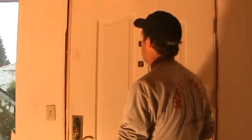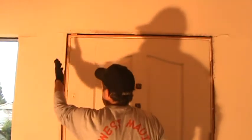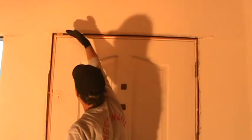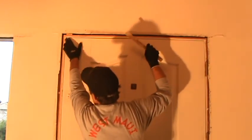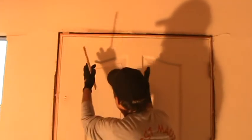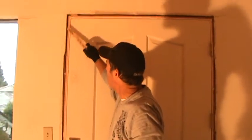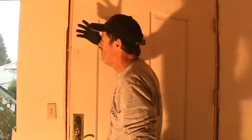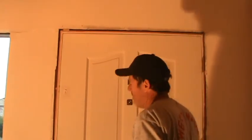This is way better than spending two thousand dollars on another door. Chances are the same thing is going to happen in a few years anyway — this may settle more and need to be adjusted again. I plumbed it up a little bit higher than level so that next time it sags, I'll still have enough reveal before it hits the door jamb. I haven't spent any money yet — the only thing I'm going to need is one caulk tube for two dollars and fifty cents instead of two thousand dollars for a new door.